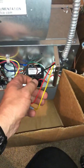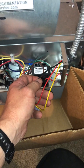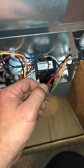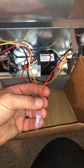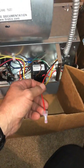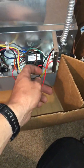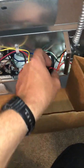You've got three wires on your fan motor: a high speed, a low speed, and a common. Your yellow wire is your common, and your red wire is your low speed. On this particular unit they are not using the low speed, which is okay — you don't have to. Low speed is mainly used whenever the heater is engaged, but on this application they're using high speed to run the heater instead, which can be done as long as it is wired correctly.